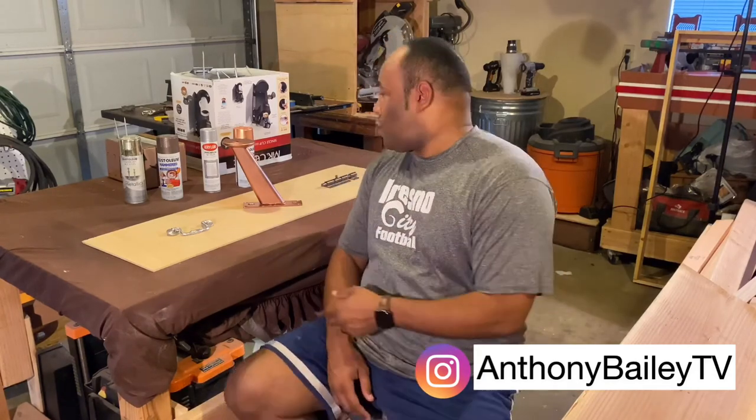All in all I think the legs turned out pretty nice and also a nice little drawer pull there. Most of the finishes turned out exactly the way we wanted them. Be careful with your spraying flow — make sure they're even swipes back and forth to get a nice consistent coating. The hammered finish turned out great for changing the texture of the surface, so I definitely recommend that as well. We will have a link to all the different sprays we used in the description below. If you'd love to continue to follow the different tips, tricks, and projects we're working on here at Bayley Built, please click like and subscribe. Until the next time, take care!